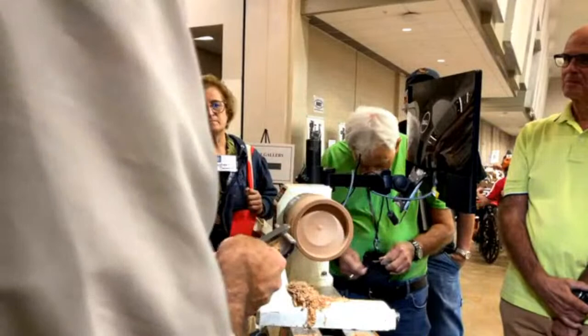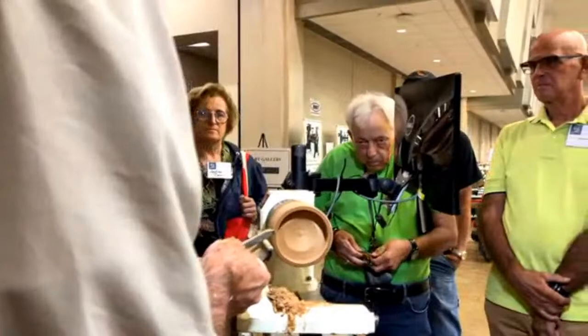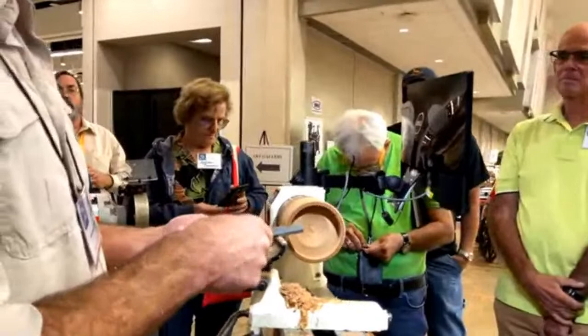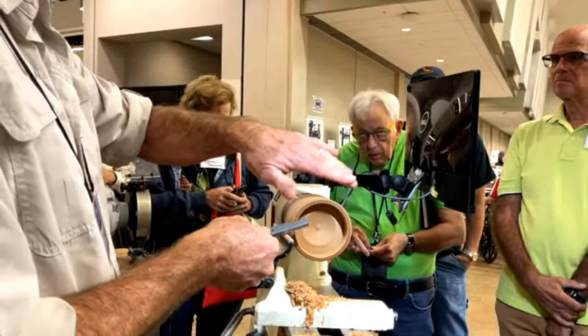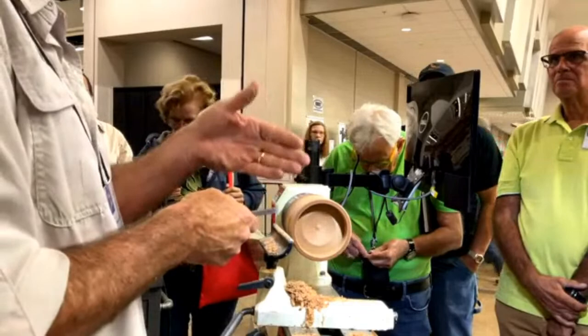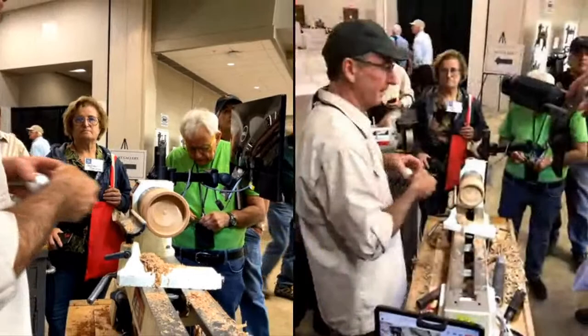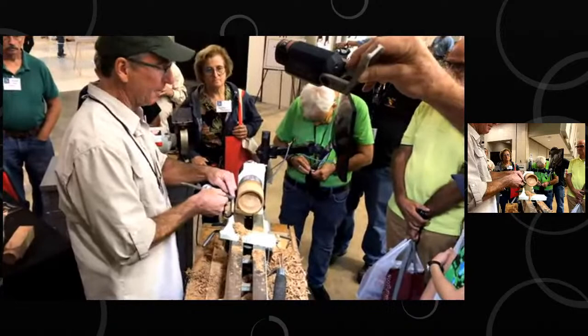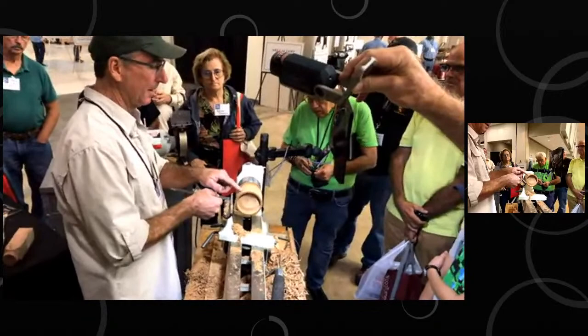Then on the front here, I'm going to put a chamfer. That's our lean-in, something soft. Now, this particular chaser is designed differently than most. I call this a whale tail. And most of the time when you're doing male threads, there'd be a wall up here. Like if you're making a box or something, you'd have to take a chaser up to that wall and pull it out. So you'd have to build a stop just before the wall so you can run that thread chaser up to the wall and pull out. Because if you don't pull out, you're just going to strip out your threads. But with this whale tail, when you finish up, you can actually get close to that wall and extend it past the wall because the chaser's been indented here. So that allows you to get kind of a better thread at the end.